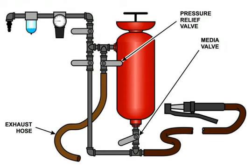This is a safety feature that is designed to protect you from injury in case of overpressure, and should not be used to depressurize your pot. Using it for this purpose can damage it, because media comes out with the air and can stick in the valve, causing it to no longer function as designed.